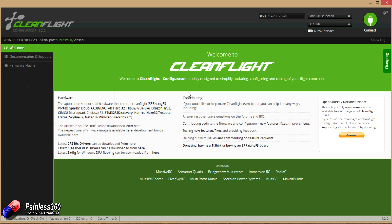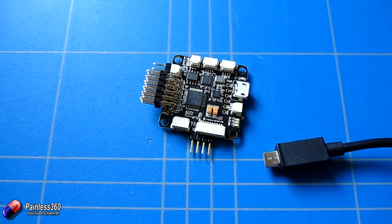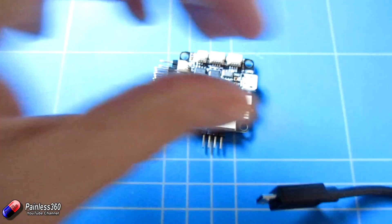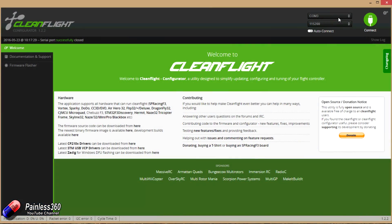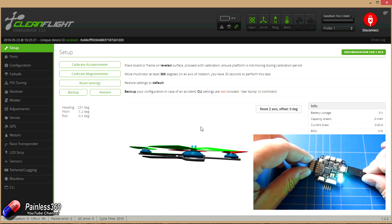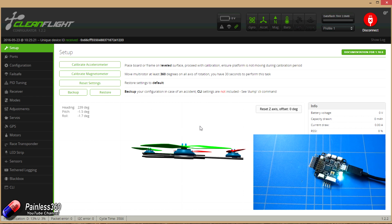Here we are on the PC running CleanFlight — you can get this from the Google Chrome store, just Google CleanFlight download. Plugging it in now. The board has appeared as COM3 which is great. Moving the board front, up and down, side to side — fantastic. At the moment we're pointing a little bit southwest-ish. We're running version 1.10. This is the advanced version of the board — you can get it both with the additional magnetometer and barometer, which we have here. The magnetometer means the board knows which direction it's pointing in.